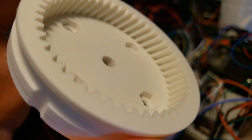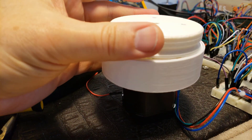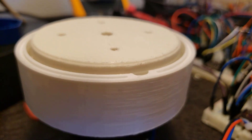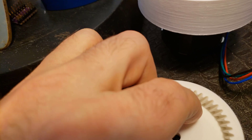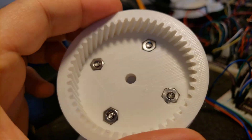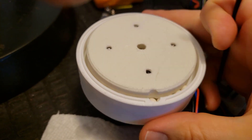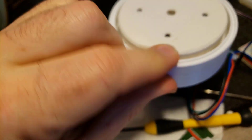I did a lot of testing, toggling the direction back and forth to break it in. The top lid has to fit really well or you get a lot of pressure on those gears, so I sanded the top lid too. When you insert the nuts, you need to crazy glue them. I initially just press-fit them without glue, and once assembled with the Airsoft BBs, a nut fell into the gear casing — I had to throw the actuator away because you can't realign the hole to pop the BBs back out. That thing is permanently closed, so be very careful.